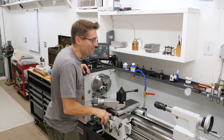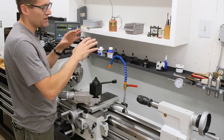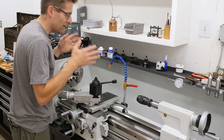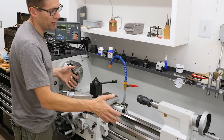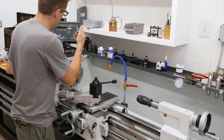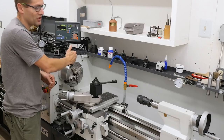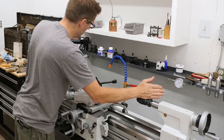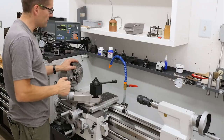At the heart of it all is the metal lathe. This is my Precision Matthews PM 1440 GT — I'll walk through features you're looking for in a gunsmithing lathe. The first is rigidity and precision: this is a heavy machine for its class, 14 by 40, weighing about 1,600 to 1,800 pounds. It's got a headstock spindle with less than a tenth of a thousandth total indicated runout — it runs pretty much dead true. Its tailstock quill axis remains in perfect alignment with the headstock spindle axis over its full range of motion as long as you clamp it to the same torque.